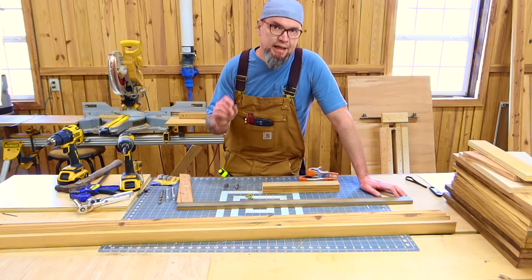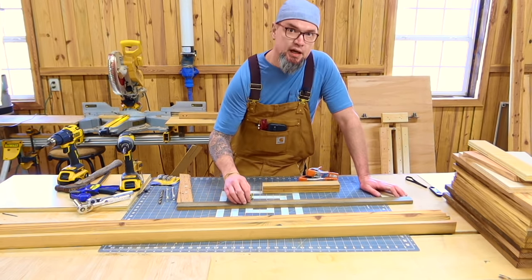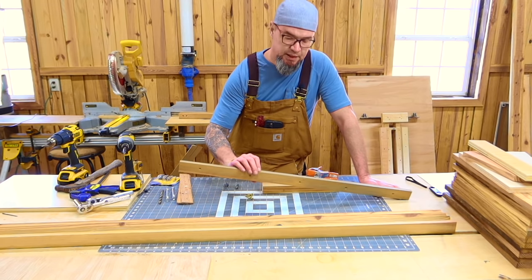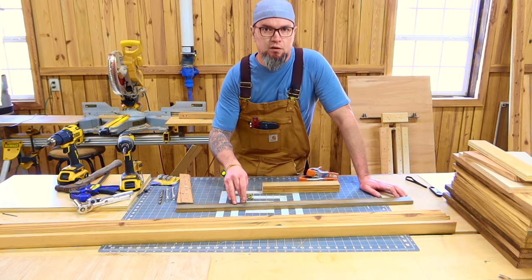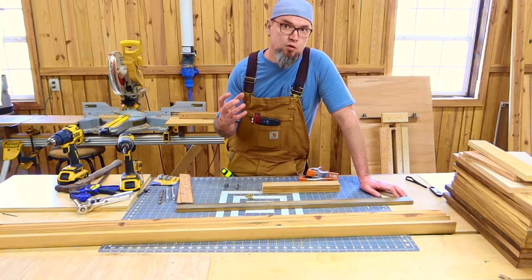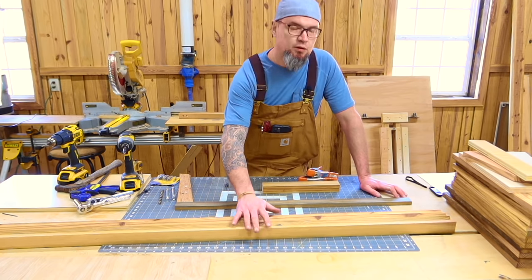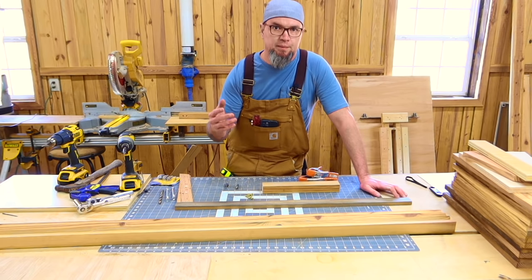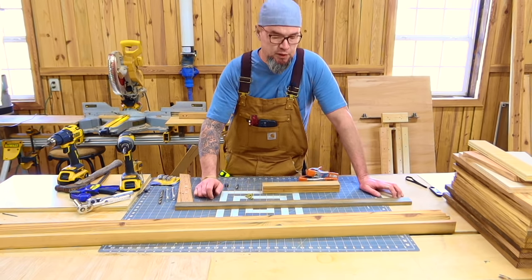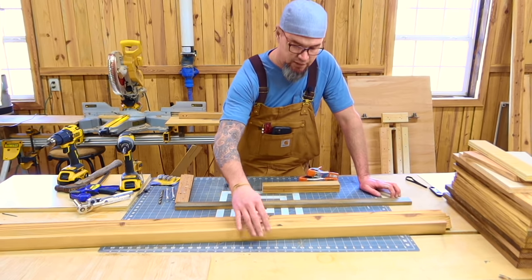All of this material is going to be made out of inch and a half stock. You can use two by fours and rip them down. The inch and a half material is going to be ripped down to five-eighths. You could go a little lighter and do half inch, but I like the five-eighths — it makes for a much more sturdy and impressive trellis. My material will look a little different; if you follow my channel, you know I like to work with a lot of reclaimed material.